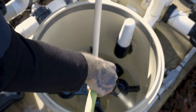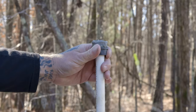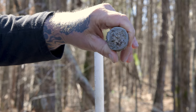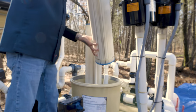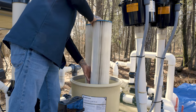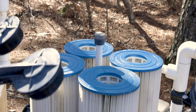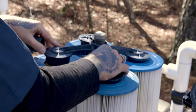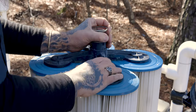Before reinserting the clean cartridges, spray out the bottom manifold and tank bottom to make sure they're free of debris. The screen cover for the internal air bleed tube can get clogged with debris — remove the screen cover and spray off the debris. Reinstall clean cartridges and make sure they are fully seated on the bottom manifold. Put the screen cap back on the air bleed tube. Reinstall the top manifold and make sure it seats firmly in the tops of the cartridges. Then reinsert the top adapter and spring with a clockwise screwing motion.